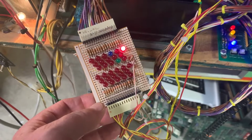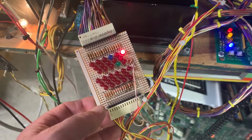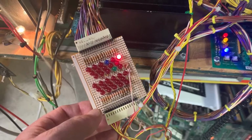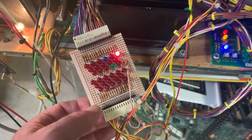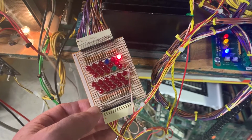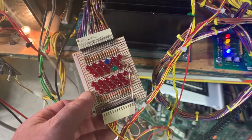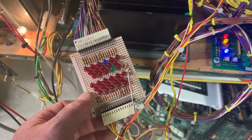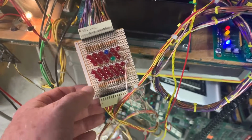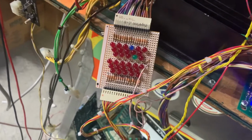Wow, it goes a lot slower in these earlier version games. That's 6, 9, 10, which is the AC select relay on other game systems, and 12, which is also a different function on other game systems. The coin lockout will extinguish, and if I let this go around one more time, then it would come on and blink. These are the special solenoids, and that proves that the special solenoids can be driven from the MPU.